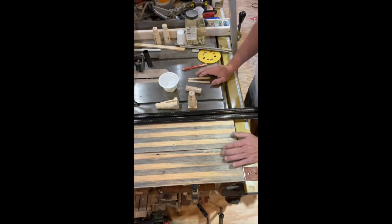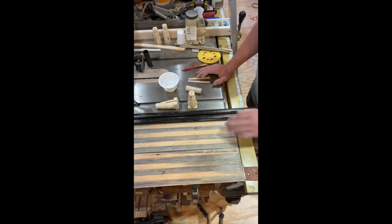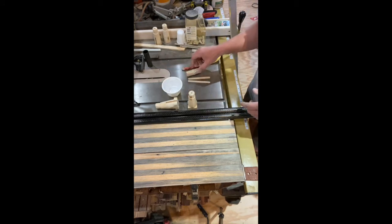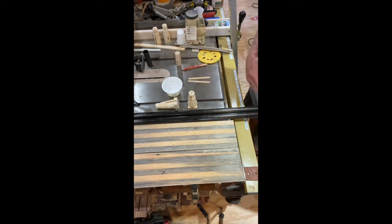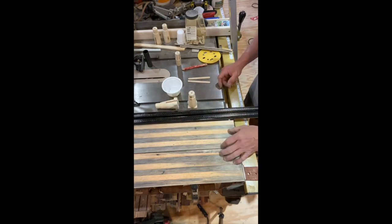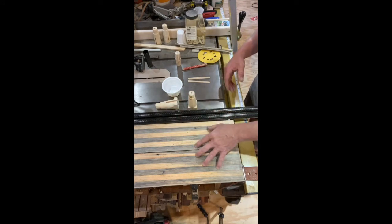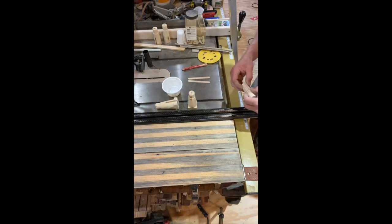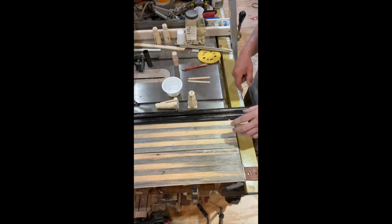The temperature is starting to get warm outside. I've sanded these lightly. I'm going to use an epoxy binding agent here rather than wood glue because I don't think I have enough wood exposed — epoxy on epoxy will be just fine. I'm also going to do my carbon fiber tube at the same time since I'll have a full pump of epoxy mixed. I'm not going to do my middle insert yet because I still need to cut these to length. These paddle lengths are slightly different, so I'll customize based on the paddles and carbon fiber tube, cut them down using a Dremel with an abrasive cutoff blade, then coat and insert to the exact length needed.